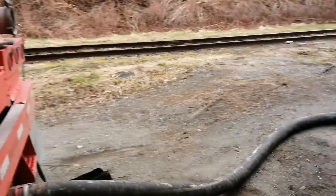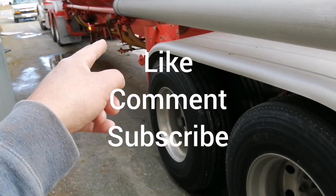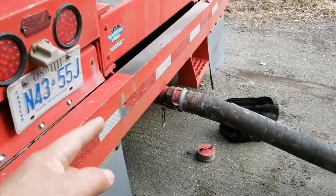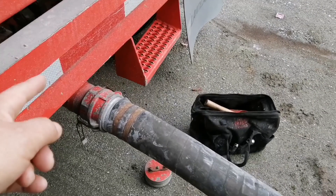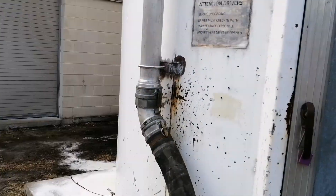It's a pretty simple process. The air comes from the blower down the bottom feed line. You open up the keystone to let the product out of the tank, then it just blows out the back here. I've got a big hose connected to the tank here, and it connects over here to the silo. And that's the silo there.